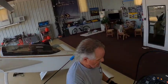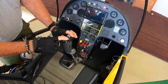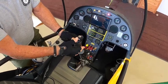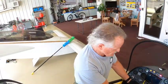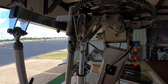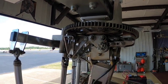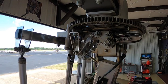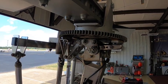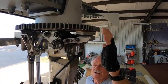I'll activate it and show you how to do it. We go to brake, and we use the aft trim — this will activate and pressurize your rotor brake system. Now if you notice, as I touch it, it pushes the stick forward. When you flip it on brake, it engages the brake shoe up into the back of the rotor head, pushes the cyclic and the rotor disc forward, and touches this brake shoe — and you have additional braking to slow the rotors down.